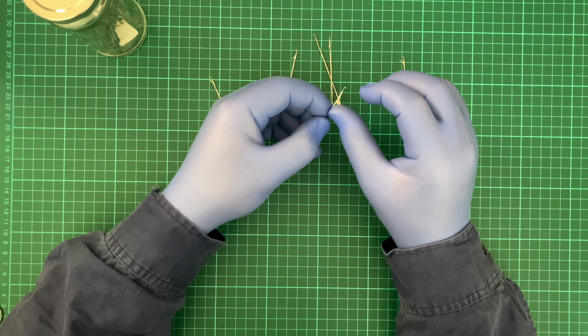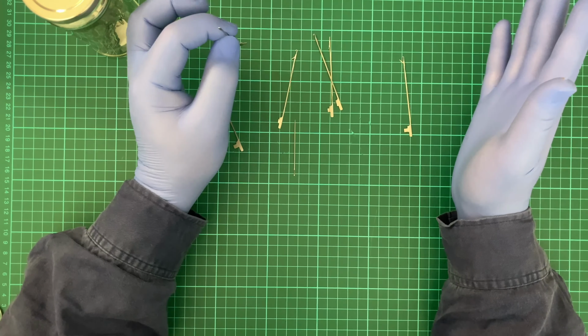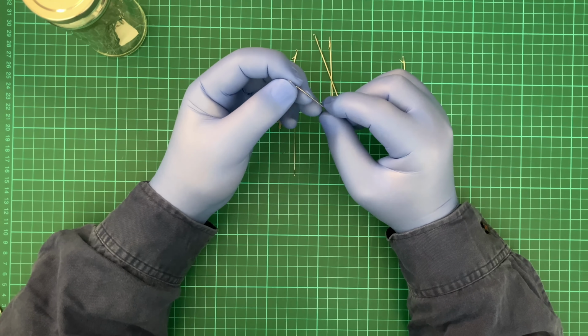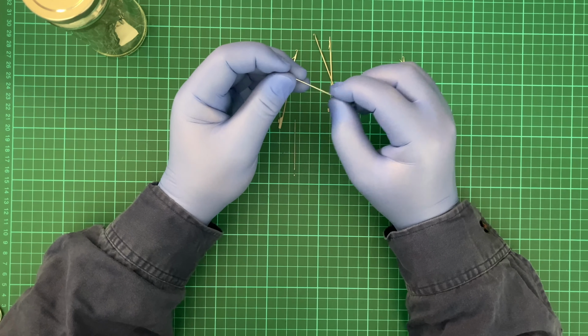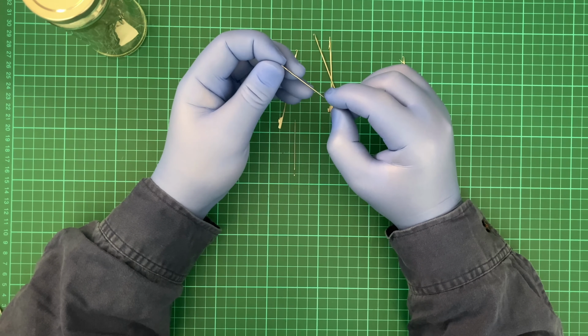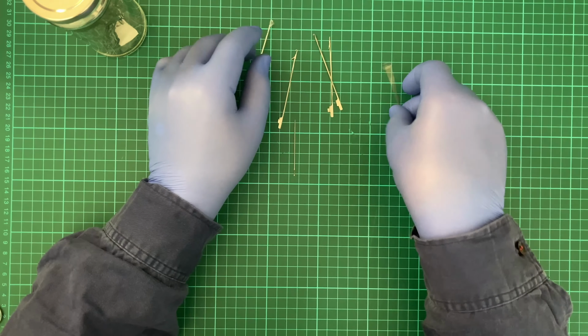It sort of skips occasionally, and sometimes it's okay, sometimes it's not. They're bad. Now, I did have someone recommend that I could just burn these and then put it back in. Although anyone who knows about metallurgy would know that that can weaken or make it more brittle. So I can see, yes, that might work. I'm afraid of applying too much heat and, well, making it brittle.